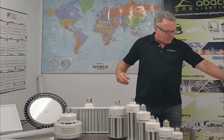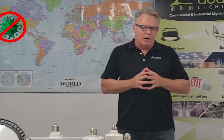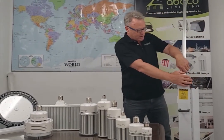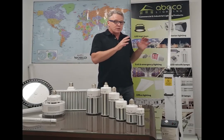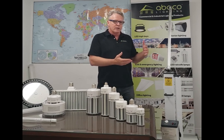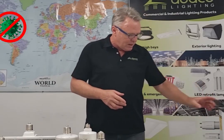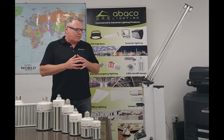Okay? Finally, the last product I wanted to show you, kind of neat, is a product that we developed during the COVID pandemic, and it's a germicidal light. This light is designed to go into a space when nobody's around, so this has what we call reverse occupancy. This is only gonna illuminate if there's nobody in the space. If somebody does walk in the room, the sensor on this unit is going to shut it off immediately, but you can set this for different time limits. This can disinfect up to a 900 square foot room in about 30 minutes.